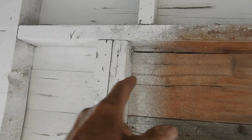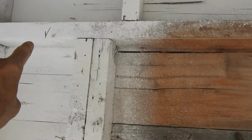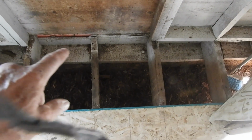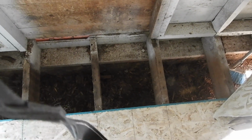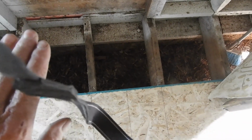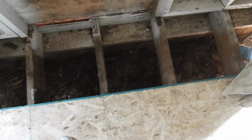Okay, getting ready to move this door to this old door opening. Luckily, I don't know if they framed it in for a new door or what, but I'm gonna go to that mark there, slide these over so we can put our big 3.0 door in. And I'm gonna fix that with some treated lumber down there. I'm gonna cut it up and fix it and make it so the subfloor goes out like a typical old building. I mean new building, not old building.